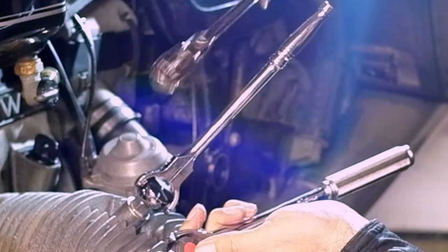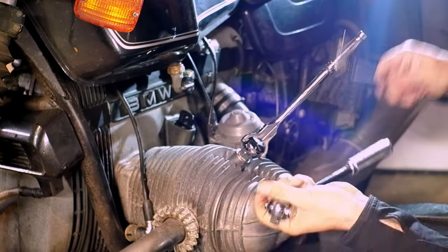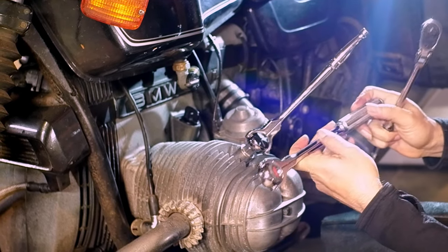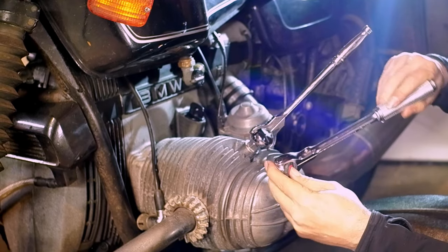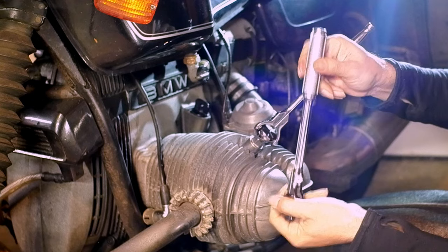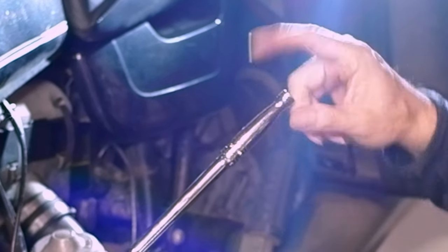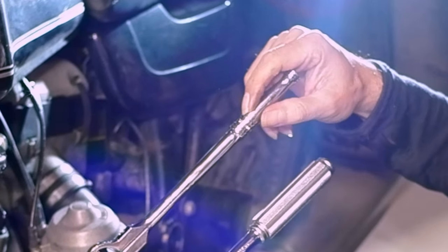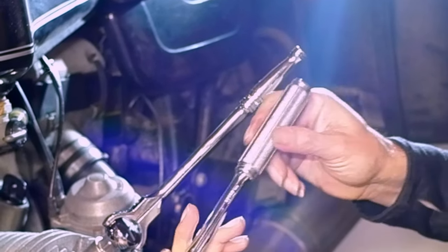Compared to the roto-head — I can push it on like that because the force is going into the anvil, not into the hinge. If you're going to use these as a normal ratchet, any of these handles will be fine — you don't need a special knurled handle, it's nice but not necessary. If you're going to use the roto-head all the way up like a driver, then this kind of handle suddenly becomes like 10 times more valuable. If it had knurling it would probably be about 30-40% more useful — which this koken one is.